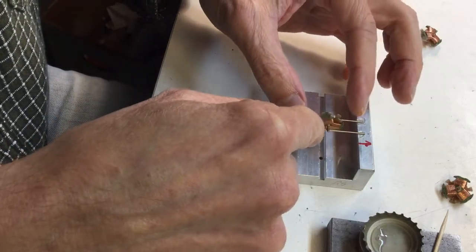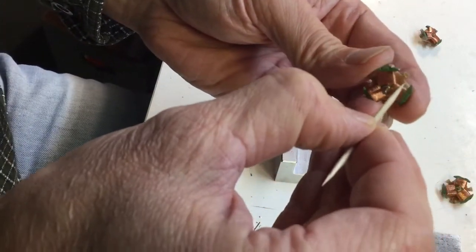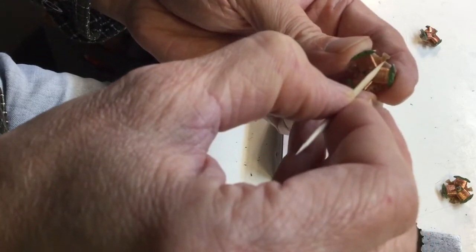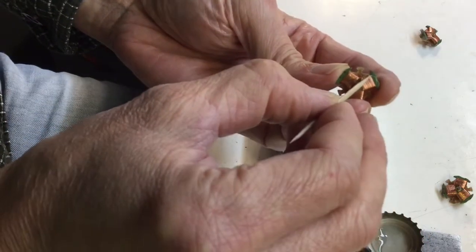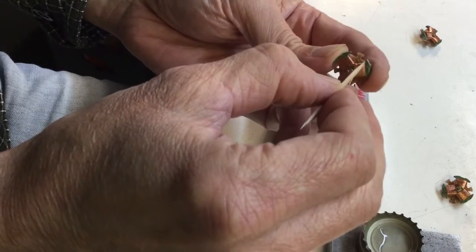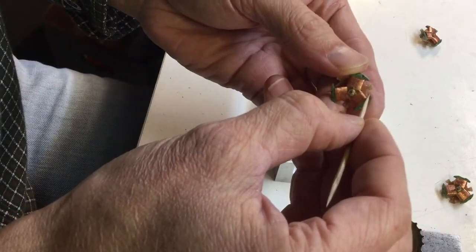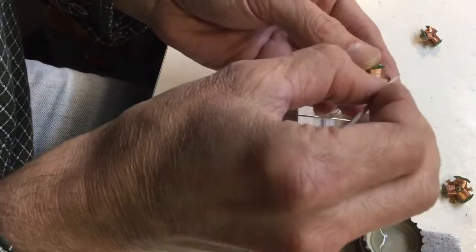It's favoring this pole right here — looks like this little crook. I always add the weights inside the crook. I wouldn't add a weight outside here because if the glue breaks there's nothing to hold it on. Up here inside the crook of the armature it'll stay there even without hardly any glue support, because that's supporting it from centrifugal force. So this pole was on the light side.